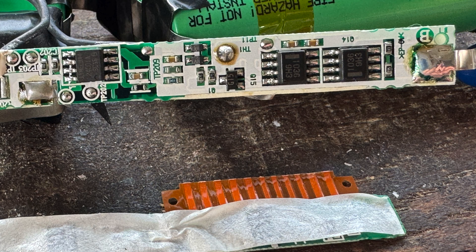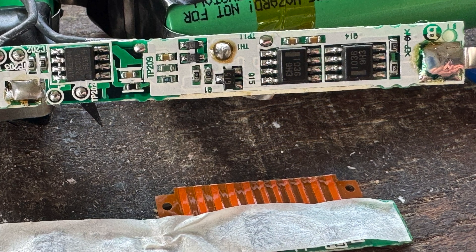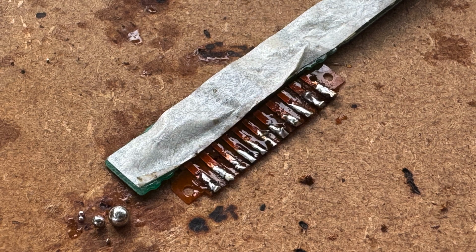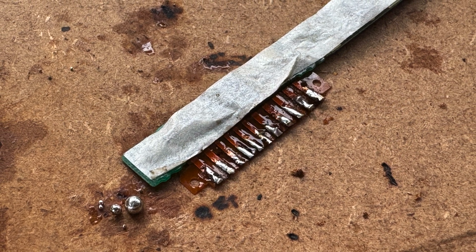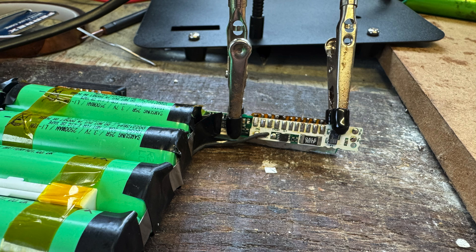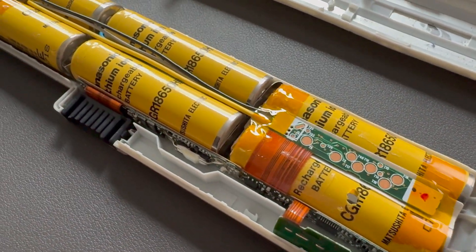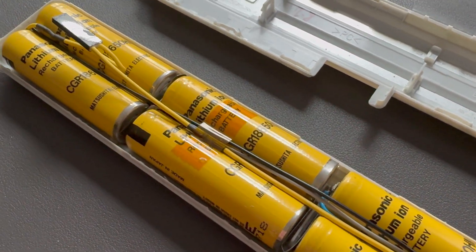And then I broke it. There are two little PCBs inside the battery and I need to get my soldering iron between them. I gently pulled them apart, but the flat flex ribbon cable snapped on one side. I figured it would be unlikely that I'd be able to fix it, but I decided to try anyway. I scraped back some of the plastic from the connector and applied some flux, tinned my soldering iron, and managed to drag solder over them. It wasn't pretty, and try as I might, I couldn't get the two boards soldered together, so I decided to give up. An hour or so later, once I'd calmed down and got over my frustration of doing something so foolish, I took a look on eBay, not expecting to find anything.